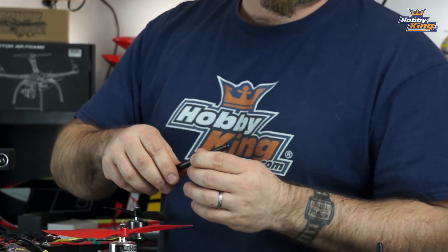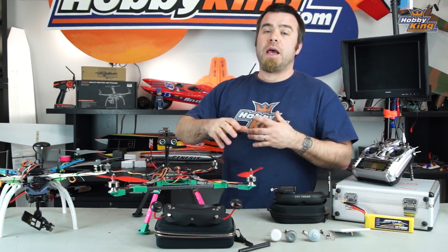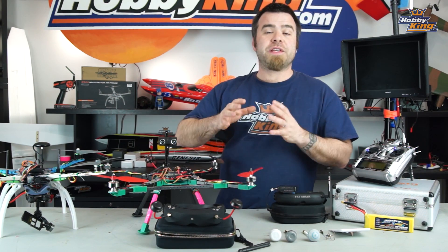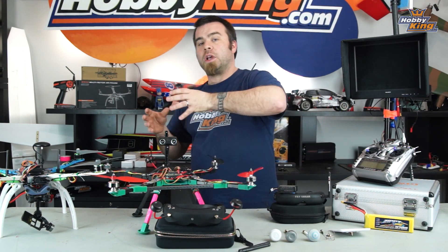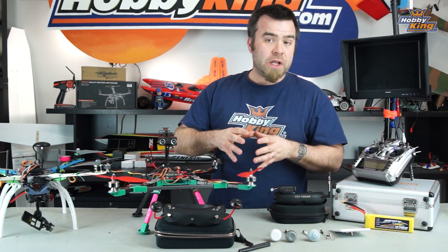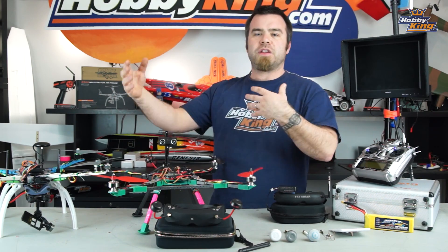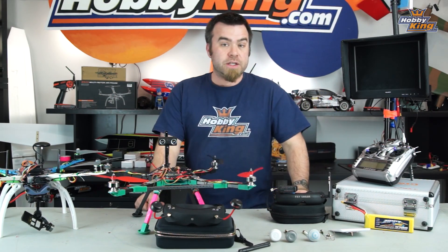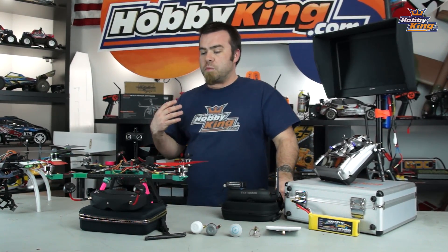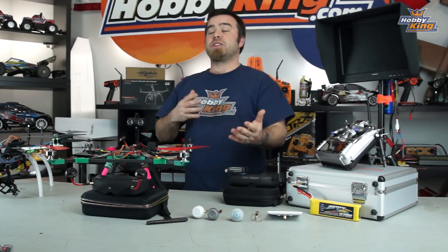You get color inconsistencies and stuff in your video feed, which causes issues. Along the way, some clever folks have engineered better solutions to improve the signal clarity and separation you get despite using low power. Originally this is all TV broadcast stuff — what we used to do to broadcast over-the-air TV. Those stations had massive power, maybe 10,000 watts or more to broadcast their video.